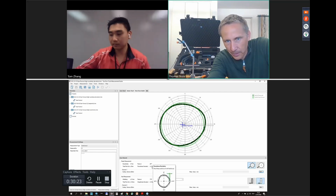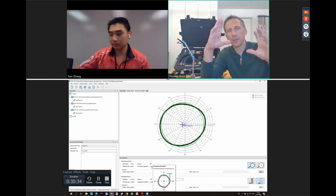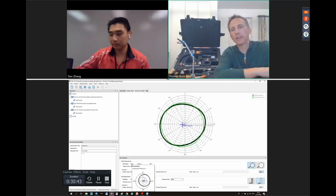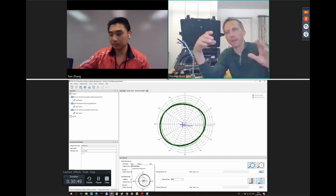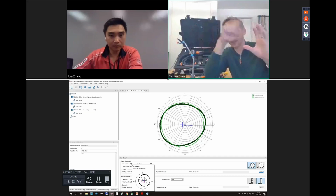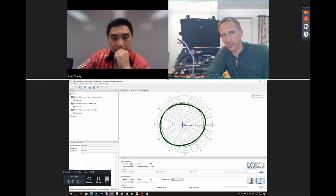When we place the cursor on the number, you will see the explanation. So the roundness deviation shows you how much it deviates from the perfect circle. And there is the eccentricity. That means how much is the gear off center? It can be any kind of potato shape, but if the average of all points gives exactly the center, it can have zero eccentricity, but roundness deviation.